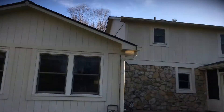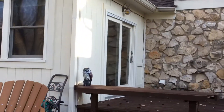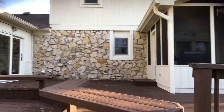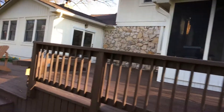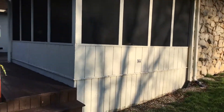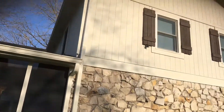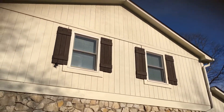Walking around here — pretty straightforward. The secondary level up here will be painted. No windows or doors here, they're vinyl. The porch door we would take care of. This is new T1-11 so we'll be painting all that on the outside of the back porch — the inside is okay, we're not touching that. Got some peeling concern here, so we'll scrape, prime, prep, and then paint it. On this last side, again removing the shutters, painting the siding and the trim.